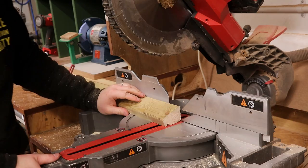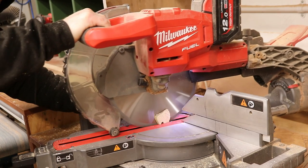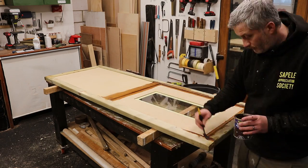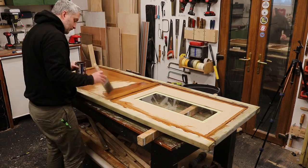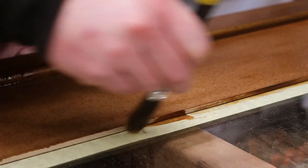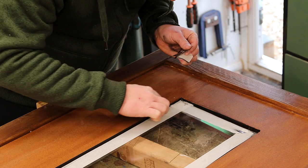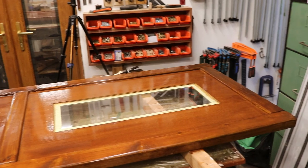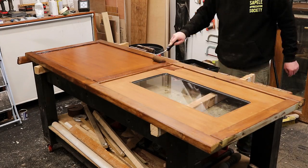This sill is going to need a slight angle cut on the end to allow the door to swing open, so I'm marking that up here and cutting it at the mitre saw. When I asked my dad what colour he wanted the door to be and he said a mid-brown colour, I was a bit gutted to be honest. But the customer is always right, especially when the customer is your dad. So here is a colour I like to call putrid brown — although on the label it actually says dark oak. This is an exterior-grade water-based stain and it'll need three coats in total. I de-nibbed in between coats with some 400-grit paper. Here's how it looks after a second coat — starting to get a bit of depth to it, but still a pretty ugly colour. And here is coat number three going on.